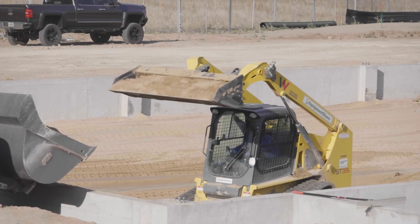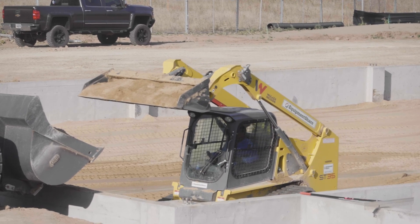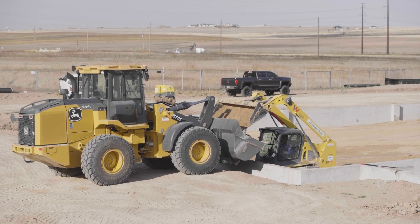The next step on top of the mats is an additional six inches of sand — that's partly as a safety blanket around the mat — then we'll use the resident soil to backfill almost up to grade, then a compacting layer, and then we'll pour slab on top of that. Once they're capped, the greenhouses go up, and that should be in about two to three weeks from now we'll start erecting the greenhouses.